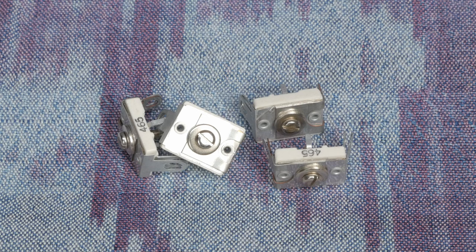Some folks will opt for ARCO capacitors in the C4 position of the PCB in order to tweak the value here. I actually ordered some of these when I started this build. The PCB isn't designed to accommodate these directly, and I was on the fence about overcoming the hassle required to install them when I found a post by GroupDIY user Kingston.